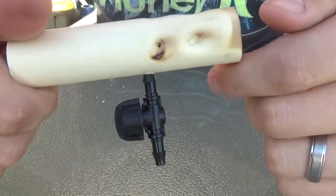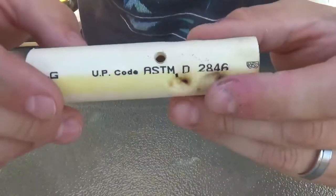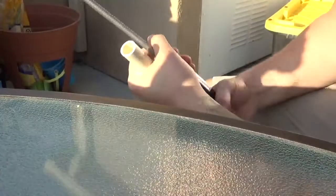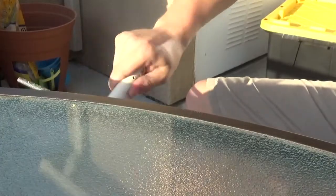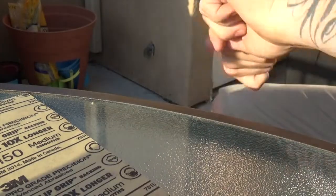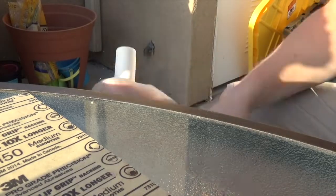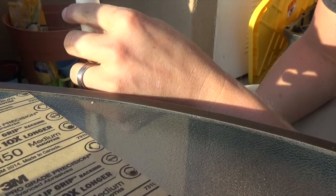Next step is taking down the sides because this is cPVC and it does not like to fit with PVC. We're going to take a file — I switched over to 150-grit sandpaper, which seems to work better. I'm twisting it against the pipe to sand it down. I'm trying to do a tapered edge so that when it's pushed into the pipe it seals itself — that way I don't have to use any epoxy.